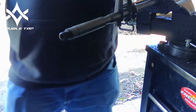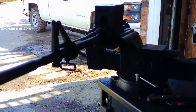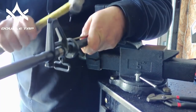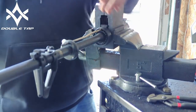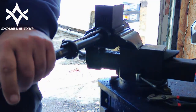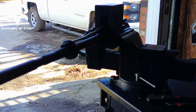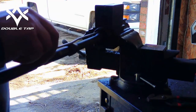Now we've got our gas block loose. We've got our gas block off now — well, loose. That's all that's holding it, so we're just going to take a hammer and tap it off. You might have to tap it past the barrel from the front. That's what the front A2 gas block looks like. We will very carefully store that somewhere, remove this handguard carrier holder, and now we can just pull our gas tube out.